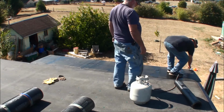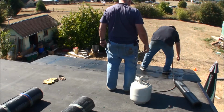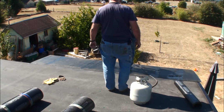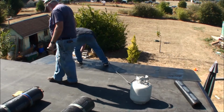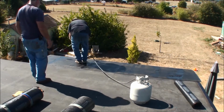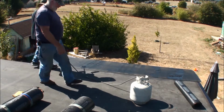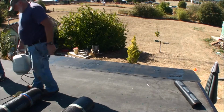And I notice here that I got the roof too hot. My feet are sticking. And I noticed later that some places it went clear down to the fiberglass. So I went and bought some roof patch and went ahead and, just in case it might leak, covered those spots and anything else that might look like it's going to leak.